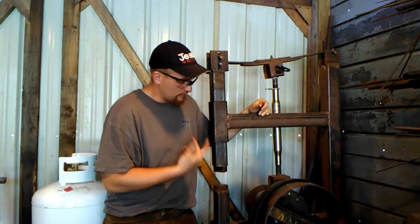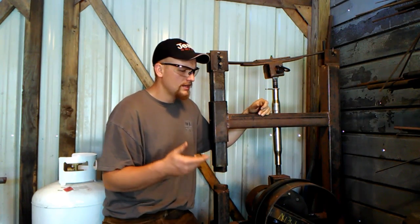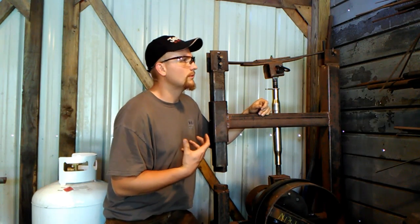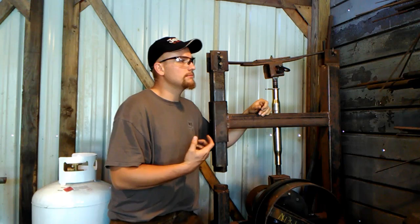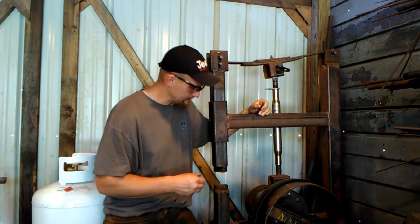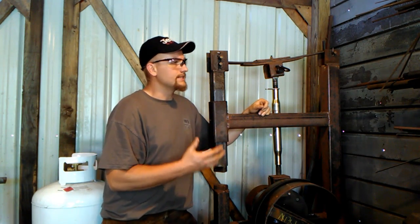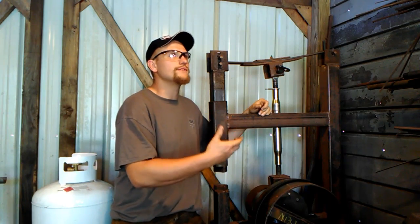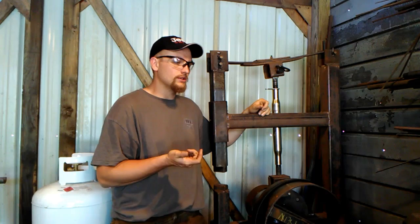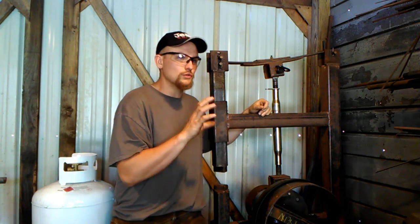This is my power hammer. I built this thing from the ground up. It was spurred off of my original DaVinci cam hammer. At that time I thought I needed something to help my iron work along, because it always seemed like the guys getting the bigger jobs and larger contracts had really large power hammers. So I designed it around what I believed a power hammer was made for: drawing out long lengths of bar, texturing edges, breaking down edges of things, double shouldering stuff.